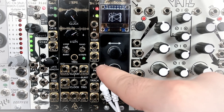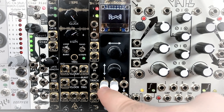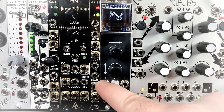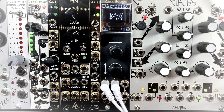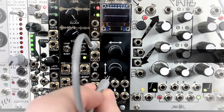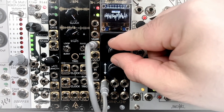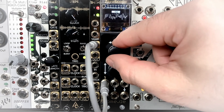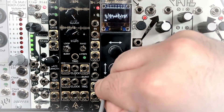The Walk output is internally routed to the IN input here. It is four separate oscillator circuits that are slewed together to give us this random positive voltage walk signal. We then have the Track and Hold output, which when not receiving a track gate is the same as whatever that input signal is, until we receive that track input and then it's held. Looking at the Noise output, it is very, very noisy — even when we zoom in super fast, it's still super noisy and we can't make out any discernible waves. And that is what is being sampled in the Sample and Hold.